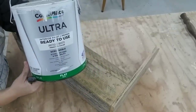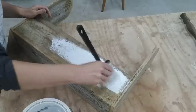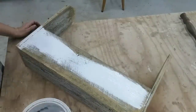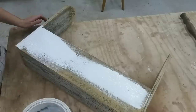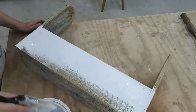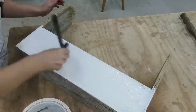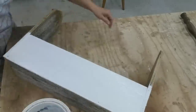To paint this piece I'm using ready-to-use off-the-shelf antique white flat paint from Walmart. It's about $13 a gallon and this is what I paint most of my wood pieces with. I put a generous coat on it — it usually just takes one coat — and I also use it to fill in all the nail holes. All you need is one nice thick coat on your entire piece.